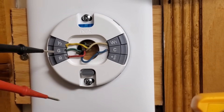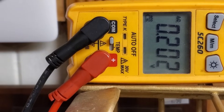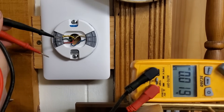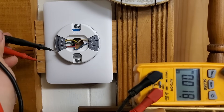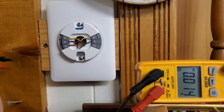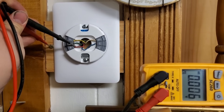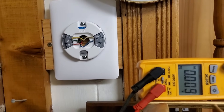It's actually the other side of the common. If we measure from G to common right now there should be no difference — essentially these are the same thing right now. You can see the difference is basically nothing. So if you don't have a common wire, which is fairly common to not have, you can measure from R to G, Y, or W and you should still be able to sense whether or not you have power at your test location. If that doesn't work you can also check from R to ground — like the metal frame of an electrical box nearby — and you'd be able to see voltage there. Just another way to check it in case you run into that situation.